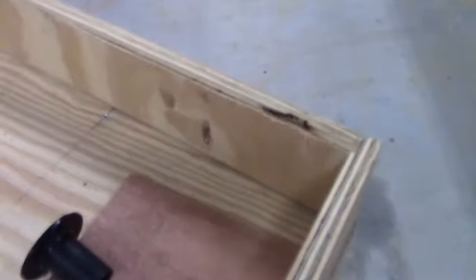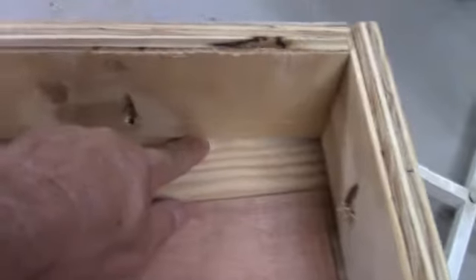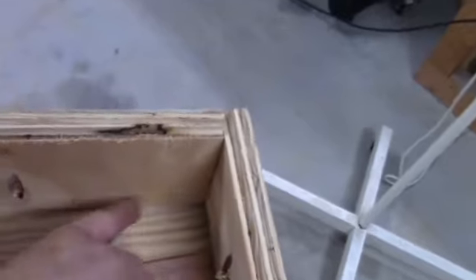The pegboard will fit down inside a little groove on the sides. The seams are screwed and glued. When I mount this to the table I'm only going to use pocket holes, then run some caulk around the edge to seal it — I don't want to use glue on the bottom in case I need to take it off and redo it. The caulk I can always remove. I'll also take some caulk and do the corners.